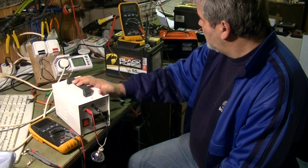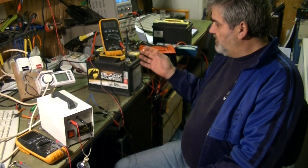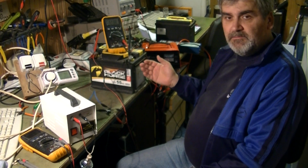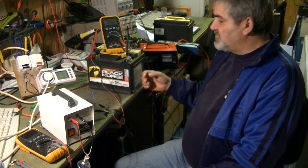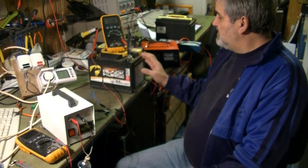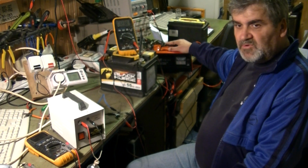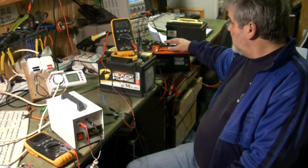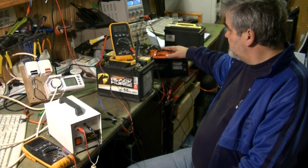If you think in this direction, whether you are talking about an electrolyzer or a battery, our goal must be to apply the lowest voltage we can, because for the same current we will then invest the minimum energy. Standard battery chargers have an output from 13.5 to 14.4 volts, in some cases even more, but they produce very fast charging.